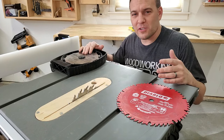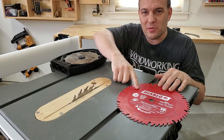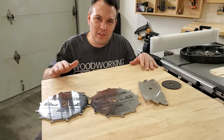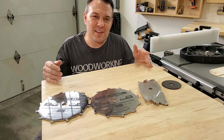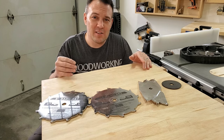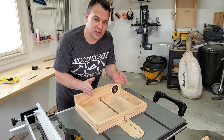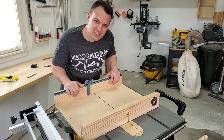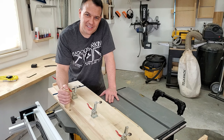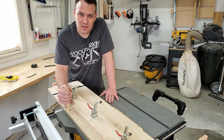To make a job site saw work for woodworking, first I purchased a few different blades better suited for woodworking, including a ripping blade, a combination blade, and a dado set. The dado set includes two blades, three chippers, and spacers. With this set I can make consistent dado slots, rabbet cuts, and box joints. In order to make box joints you'll also need a jig. I also made a crosscut sled for safer, cleaner, more accurate cuts and a tapered jig for making tapered cuts or putting a straight cut on a piece of rough sawn lumber.